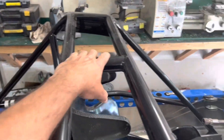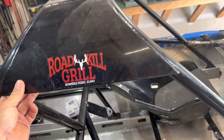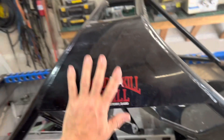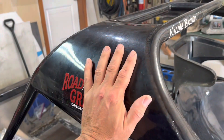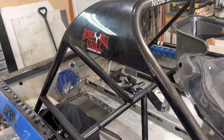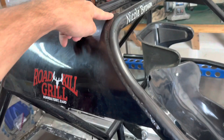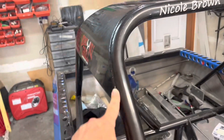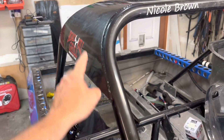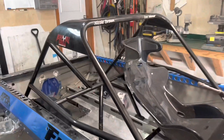You've got to have a crossbar — only one is required up here. But then you also have to have a capping plate. I'm pretty sure that's eighth-inch capping plate on the corners, which really strengthens the corners. It also acts like a snowshoe when the boat rolls, and it has to protect and strengthen the entire radius of each one of these bends. That's the purpose of the capping plate — to tie everything together.